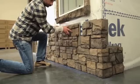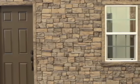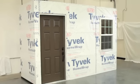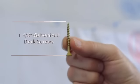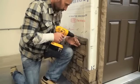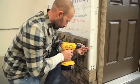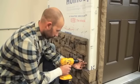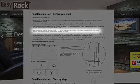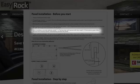Install the panels in an offset pattern so they do not line up at the edges, as this makes a much more natural appearance. When panels are being installed into a wood substrate as we have here, use seven 1-5/8-inch galvanized deck screws — five evenly spaced out on the top tongue, and two evenly spaced out into the right side tongue, and countersink 1/8-inch into the panel. When installing into a concrete substrate, please refer to our installation guide posted on the EasyRock website.